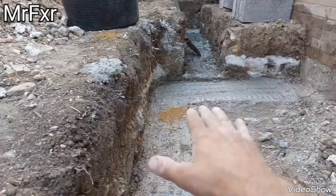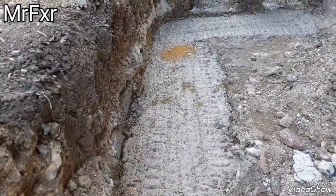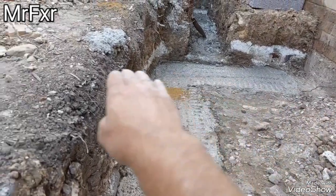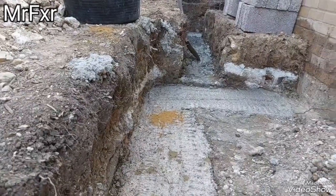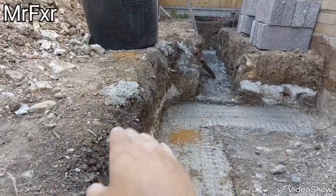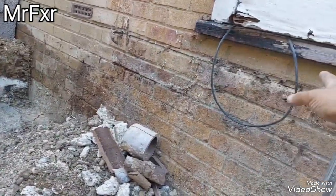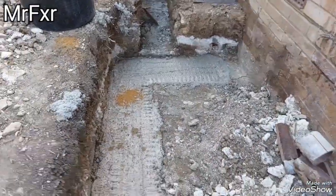It's gonna be a cantilevering slab that will sit on the footing that is past that pipe, because I don't want to disturb that pipe. So I got my footing, 4-inch wall comes up, reinforced concrete slab comes over, then I can build my stud wall up off that edge. Again, same as on the front, I'm gonna have a couple courses of brick, DPC, so it's all gonna be separated from the ground, nice and dry. Few vent bricks, and the void above the slab is gonna be vented through the house, through this wall here, to the vent bricks, and it's gonna be all nice and vented.